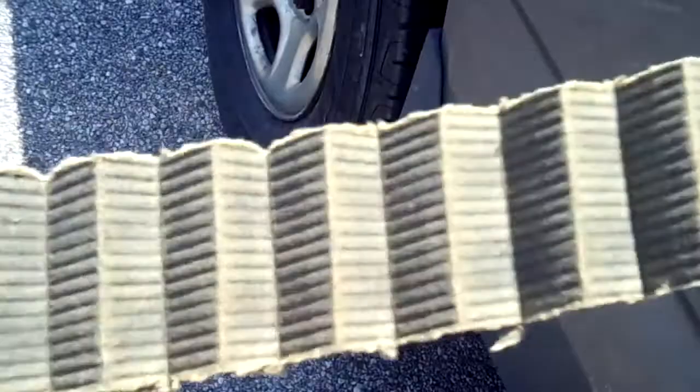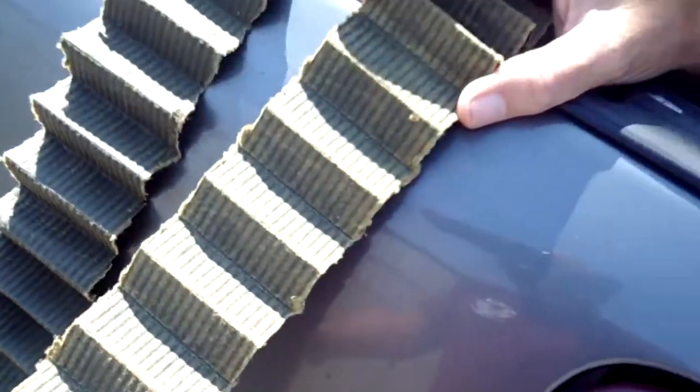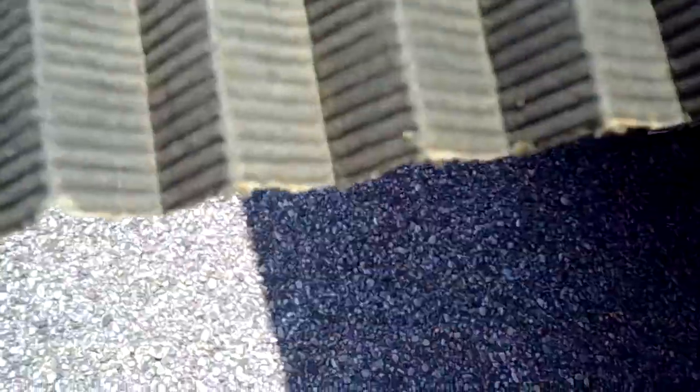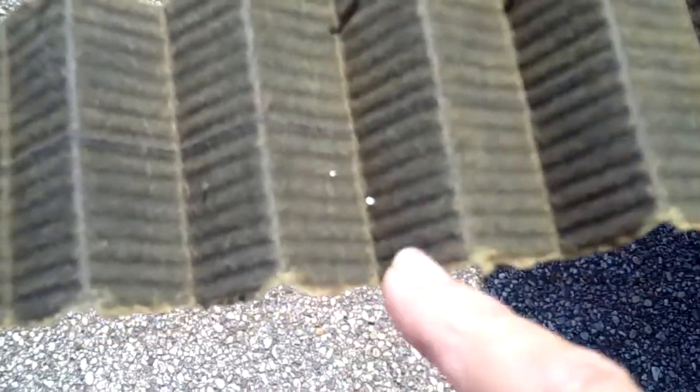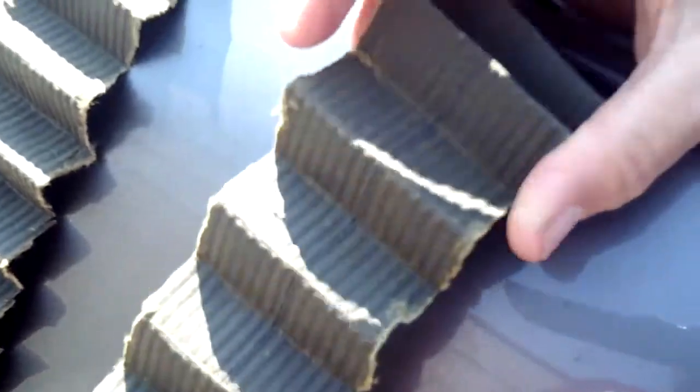There's one right there on the ridge that you don't really get to see. Matt's holding the other end of the filter element — here's the filter element after being cleaned. There are a few little pieces of glinting aluminum in the filter; they're really too small to show up on camera, but Matt will point one out with his finger. Let's flip it over to the other side and you can see a couple more pieces in here. We've also filtered all the 100 low lead used for cleaning through a coffee filter and now we have it on a napkin.